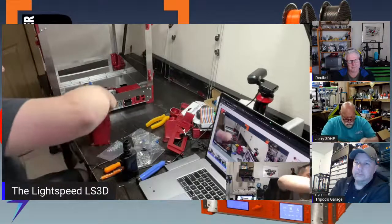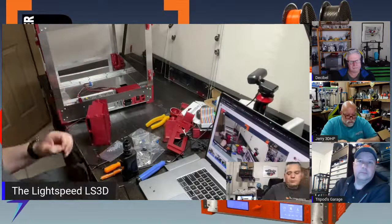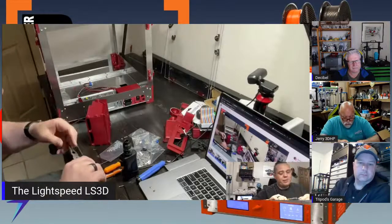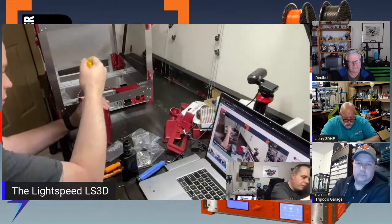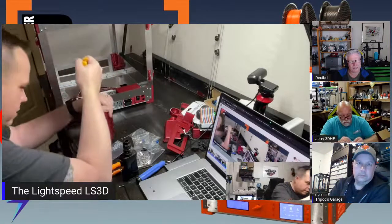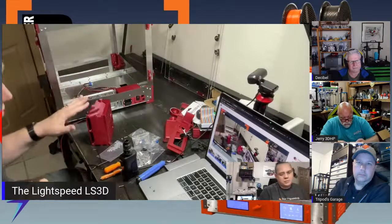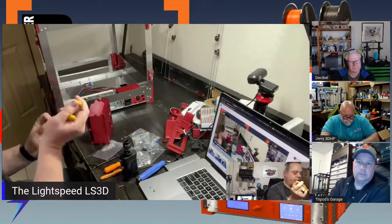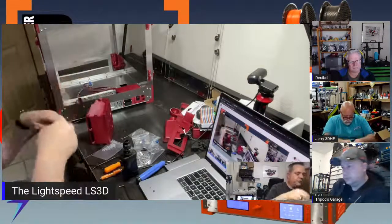For some reason, maybe because it's a Core XY or something, when you slow the printer down, it gets worse. You think, oh, I'll slow it down to more modest speeds, but no, that's a bad idea. The Rail Core likes to go super fast, and if you slow it down, it starts skipping steps. I don't know, it's strange. This material is tried and true and proven on the Prusa, and it just does a better job. That's the best part about the Prusa, all the tuned profiles.